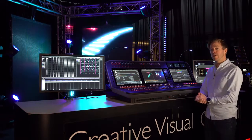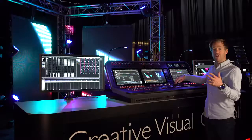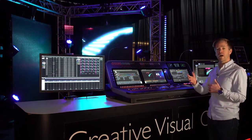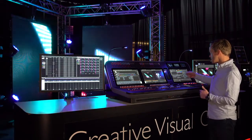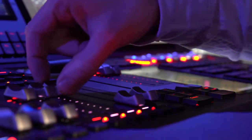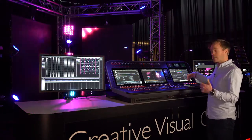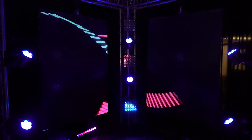One of the new pieces of hardware on the D9 is the T-bar, introduced to further enhance our scene master functionality. The scene master allows you to make changes to the active playbacks and programmer, then execute those all to live over a manual or pre-timed fade. In this example, I'm going to enter preset mode, change the media server layer outputting to the screen, change the video content, and when I'm ready to cut to live I'll move the T-bar to transition to the new look.